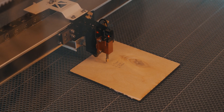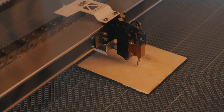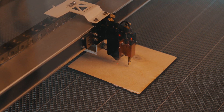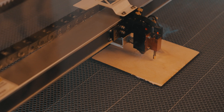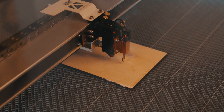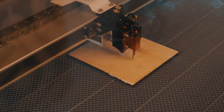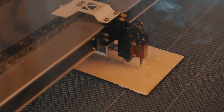We're going to return back to our starting position and go down from there — just below our 6.5 millimeter dot. We'll get the Z height down to around 7 millimeters. We're going to do that same procedure in the opposite direction: hit escape, do a pulse, then go down and lower the bed about another half millimeter, send another pulse through, and continue that pattern until we have a sufficient amount of dots to see the pattern of the focal height.